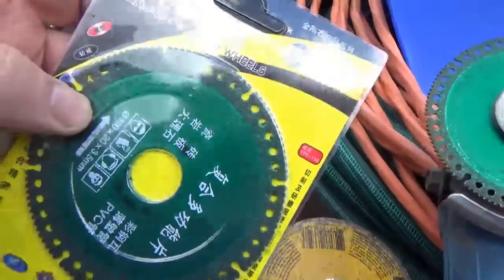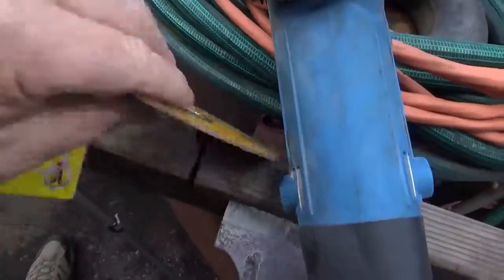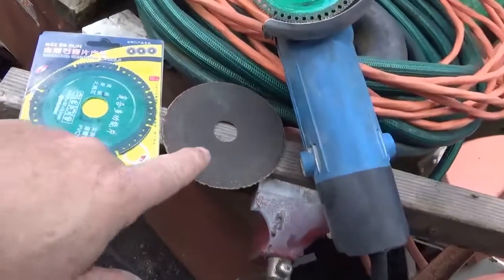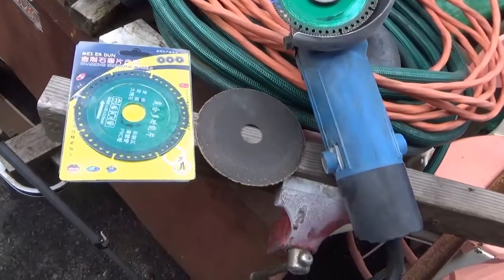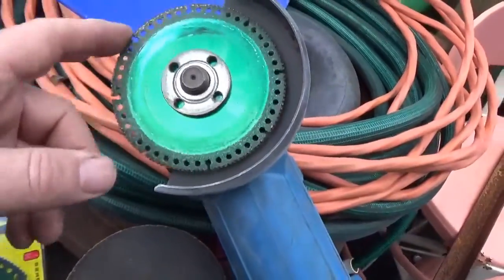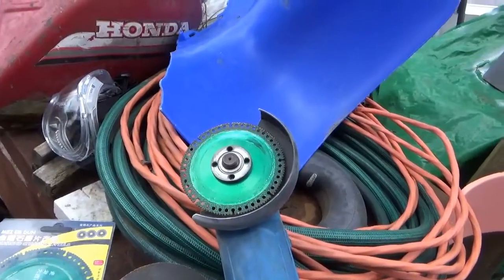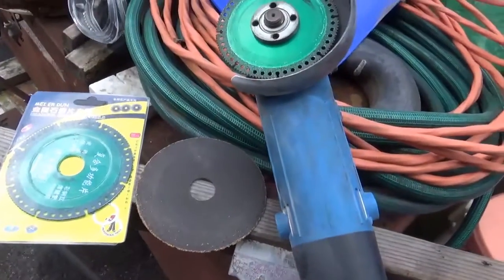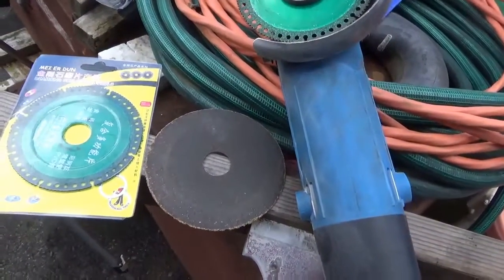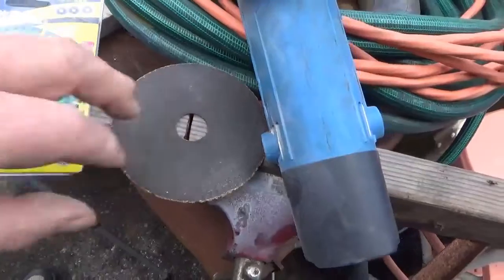When it comes to cutting metal, whether you're using this disc or your typical abrasive wheel, I'd put them more or less equal. I think I like the abrasive wheel a little better. Seems a little smoother. When it comes to safety, I'd probably put the Indestructible further out front. I think it has less tendency to fly apart than the wheel. I think. I don't know. I haven't had one of these launch yet. I've had wheels come apart, and I've seen the damage done to folks when the wheels come apart. That was one of the reasons why I wanted to look at this.